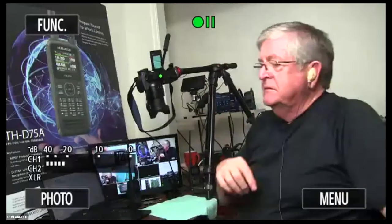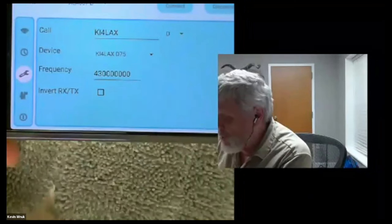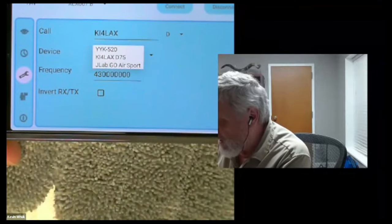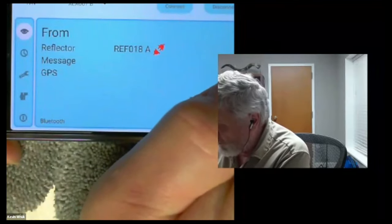Kevin, can I pause you for a second? Yeah. Go ahead, Mark. Before you turn the app on, you have to go to the config and set your call sign. That was one of the things that confuses a lot of people. Okay, yes. Better? Let's see here. There you go. Yeah, the wrench. So hit the wrench, put your call sign in, and that's where he actually has his call sign in, the guy who wrote the software. So you have to replace his with yours. This is where you choose your Bluetooth that you have, and frequency you ignore because we're not going to use it. And then just go back up there and hit your on.